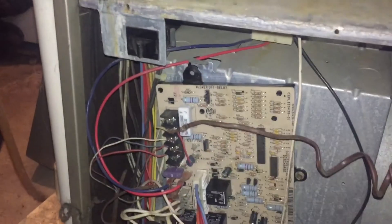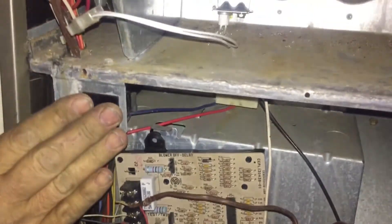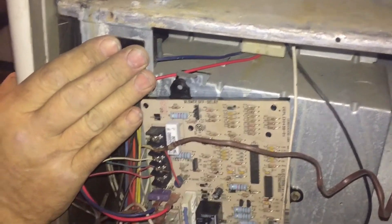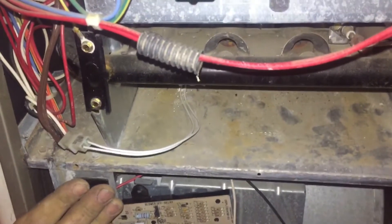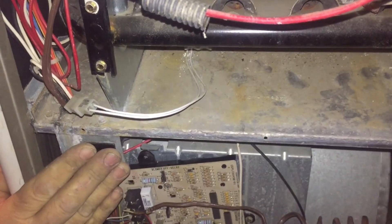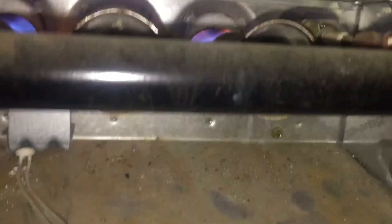We're going to hold the safety button in by hand — or you can put a piece of tape over it — then turn the furnace on and see if it comes on. The first thing that should happen is this little motor here should start spinning. You can see there is fire in the firebox, the burner has ignited. You can see the glow plugs turning on — it's going to start the flame here pretty soon. The inducer is spinning. We have flames.